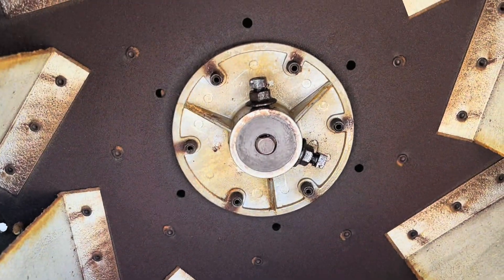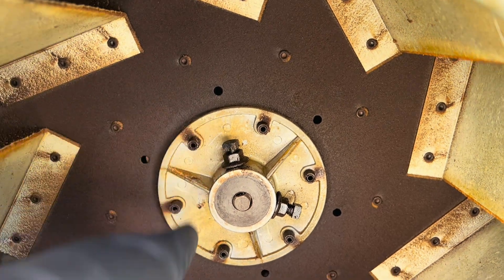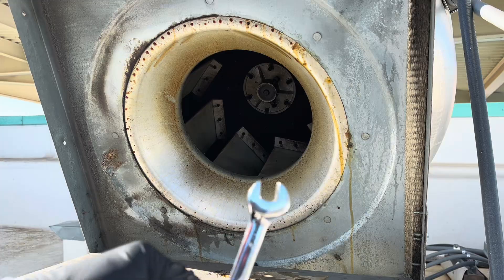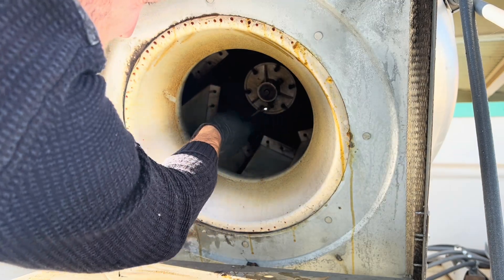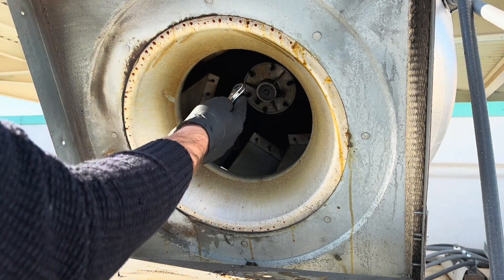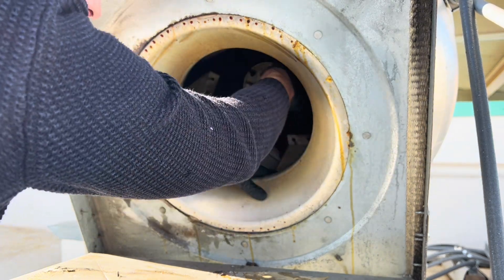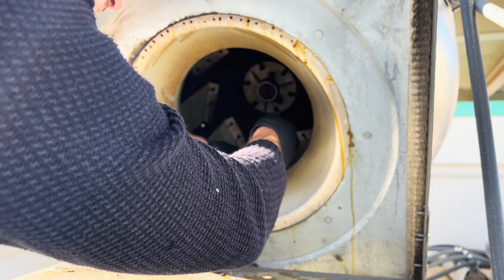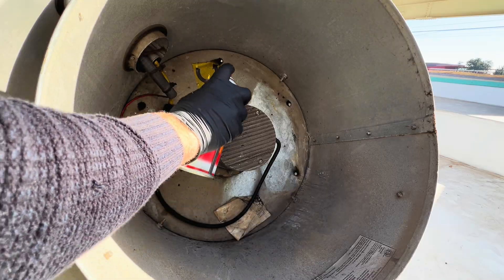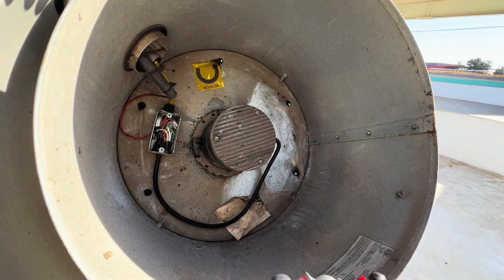You can see these set screws — this one you have to tighten, that is half inch, and this one is three eighths. That's apparently the entire thing of what you have to do. The set screw itself is three eighths. Now we have to undo this — I'll spray a little bit on this just to make sure they're coming out.